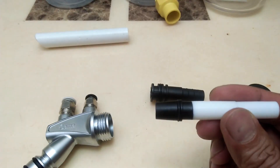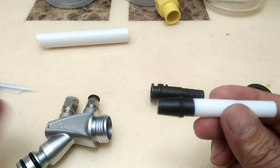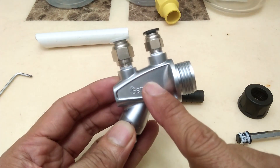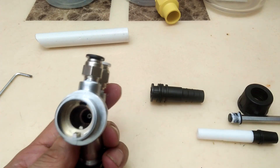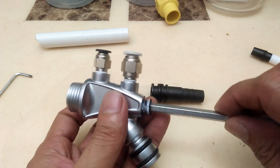A jet of compressed air from the nozzle goes past the opening of the powder inlet. This creates a negative pressure called the venturi effect. The powder is drawn out of the hopper due to the negative pressure and forced out to the hose connector outlet of the pump.